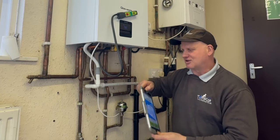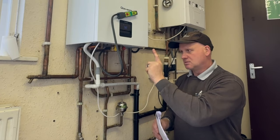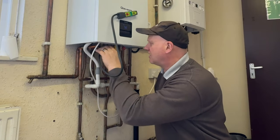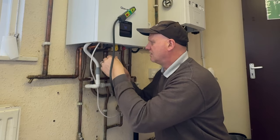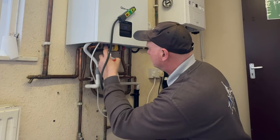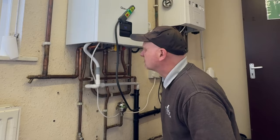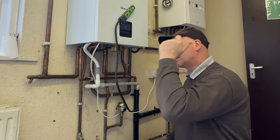Now I am going to gas rate this on central heating and I will be doing those figures. So now we've finished here, I can take off the inlet test point. I found a little 8mm spanner is the best for removing the test point on here. I'm just going to whip that off and screw it in — just nip it up with my spanner — but I need to test it with my LDF. Make sure it goes all the way around, leave it for a few seconds, and it's not leaking. So that's the test done at the meter and into the boiler.